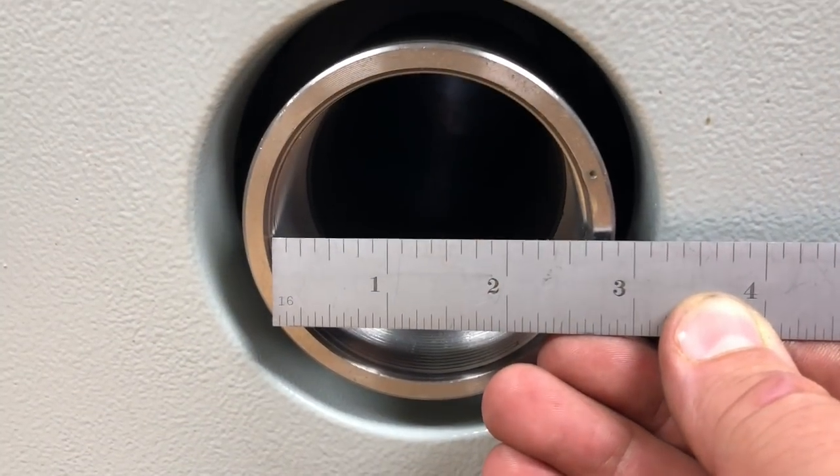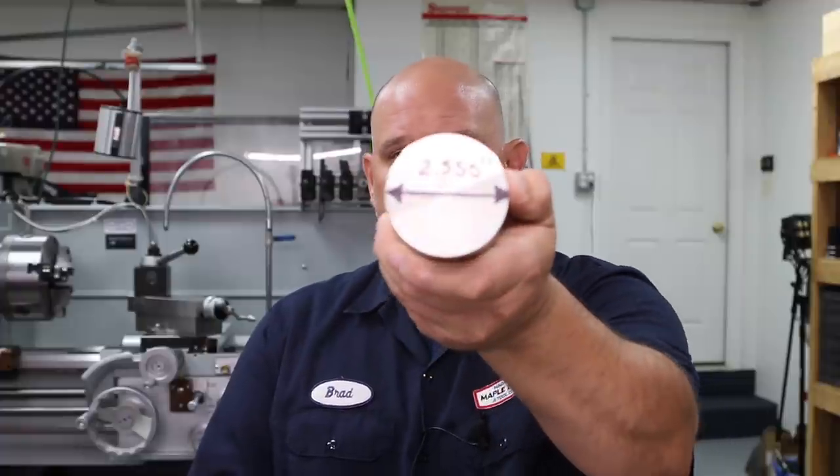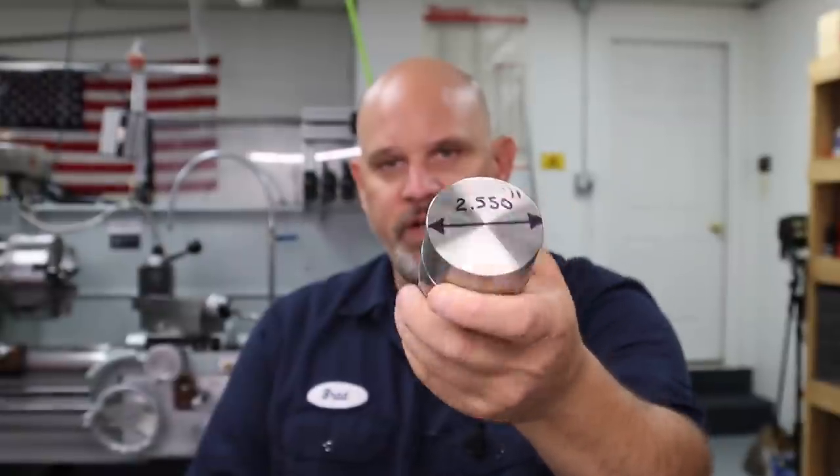I've been working in the shop for several years doing the Maple Lane business, and I had a little South Bend 10-inch lathe which I loved dearly, but I outgrew it. With the variety of work my customer was giving me, I ran into many challenges with that small lathe, and trying to get around them often became dangerous. The work envelope on some jobs was just too big for the little machine. The first and foremost reason for upgrading was a bigger spindle bore — this machine has a 2.550-inch spindle bore to allow two-and-a-half-inch stock to pass through it.